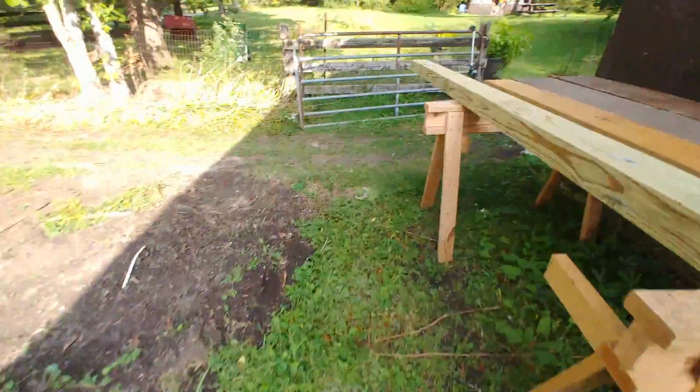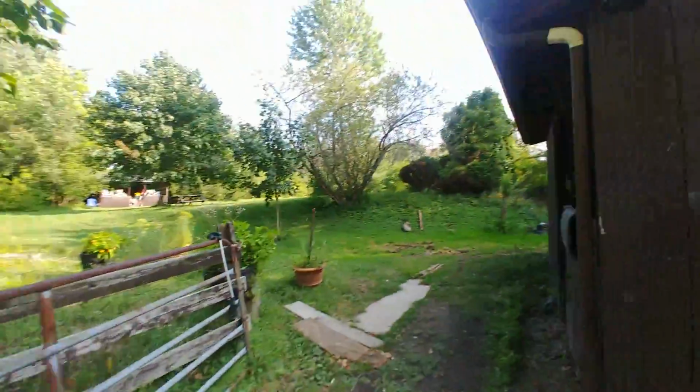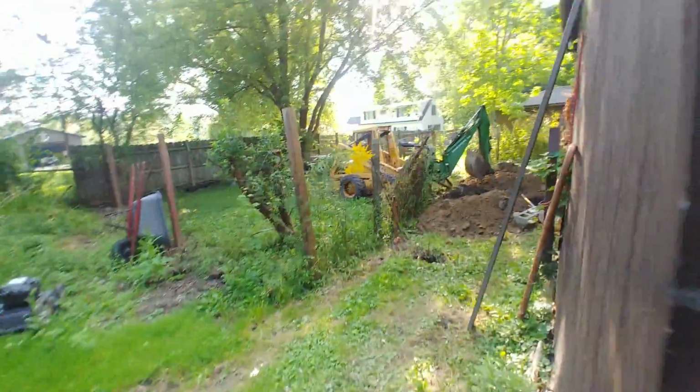I did also take the level outside. Seemed to me that that wall was tipping in, so I took the big long 8-foot level outside and I used it vertically, which we call checking for plumb, as opposed to horizontally, which we call checking for level, using the tool called a level.